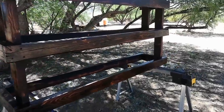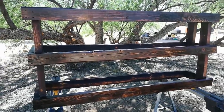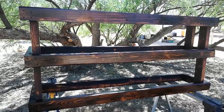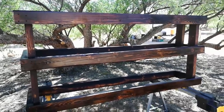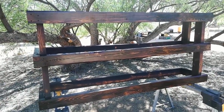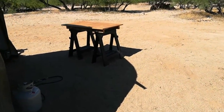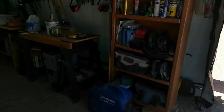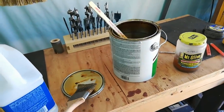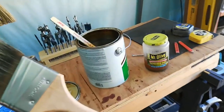Then I'll take it into the solar shed and assemble the rest of the surfaces inside the shed — otherwise it's just going to be way too heavy to deal with. The next job is cleanup. I'm going to walk right in without cutting the video because there's something I want to share with you. The one thing I learned a long time ago is if you're going to buy paintbrushes, buy a good one and buy the one that's proper for the job. This polyurethane, which is a spar urethane, oil-based, calls for a bristle brush.